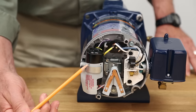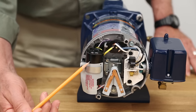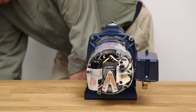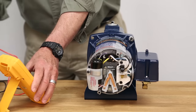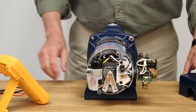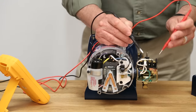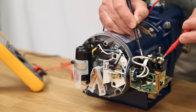You can usually tell if the capacitor is bad by the black seepage coming from the vent port on the top of the capacitor, but the best way to check the capacitor is with a capacitance meter. When installing a pump, one should meter the voltage being supplied by your power source to ensure that the voltage is matched for the way the motor is wired. While a duplex outlet with a proper prong configuration should be 115 volts, it may not be, so always pull out the volt ohm meter and confirm the voltage coming in.